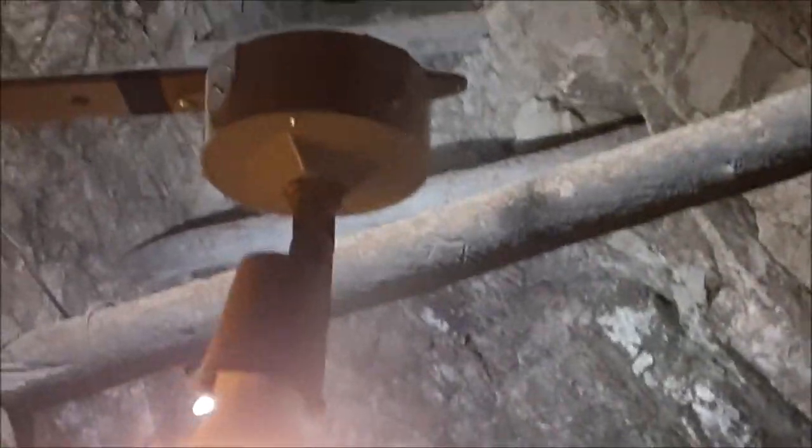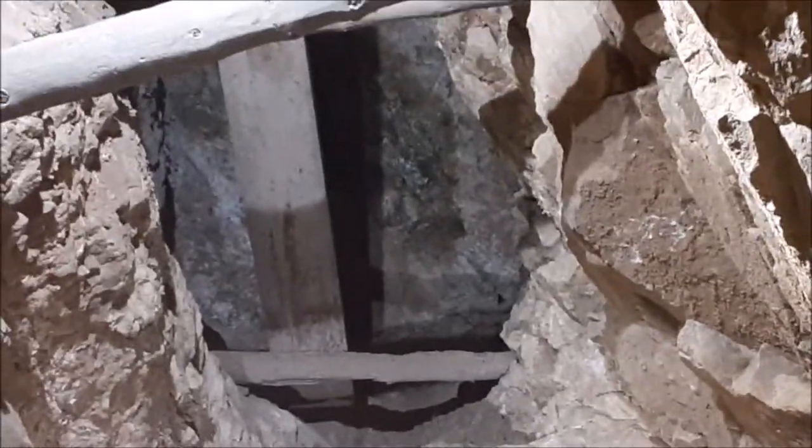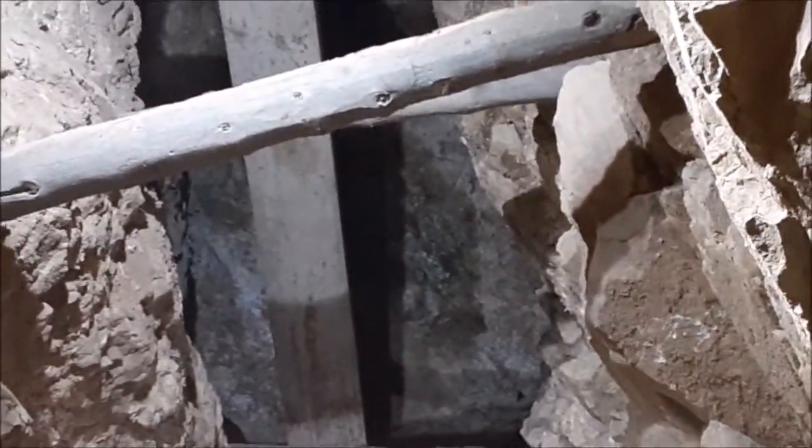What we're standing at is just the beginning of a stope, but if you see that flat board up there, that's called a drilling platform. And we'll stand up there with the stope drill and hammer into the rock directly above us, just like you'll see in this picture to your left. Now we are going to see this drill in person in just a few minutes, but as we're hammering into the rock directly above us, that would first knock the rocks around us loose.